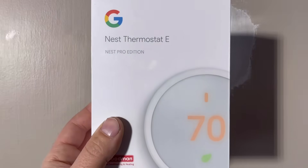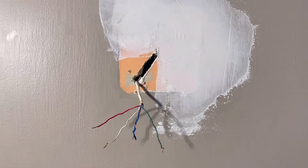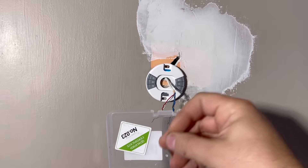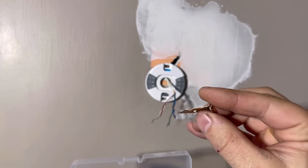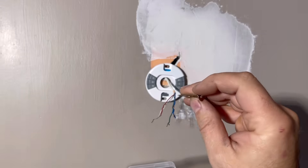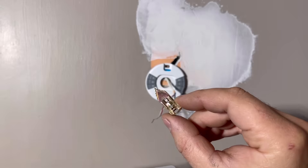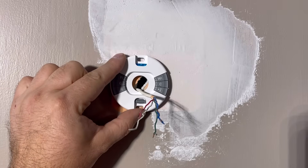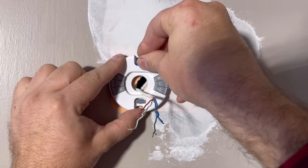This is the thermostat we're going to be installing — it's a Nest Thermostat E. We're going to unbox this and go ahead and install our base plate. These are the anchors we're going to be using — these things are my new favorite anchor. They are fantastic. All you do is drive this in with a hammer, and then this duckbill will expand. It's perfect for thermostats and things that are small but still hold very well. Once we've found exactly where we want the thermostat to be, we'll take one of these screws and just make a little indentation.